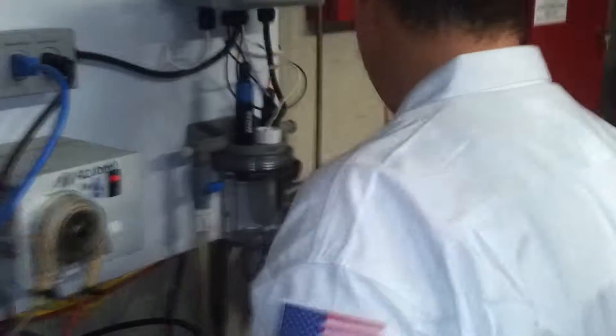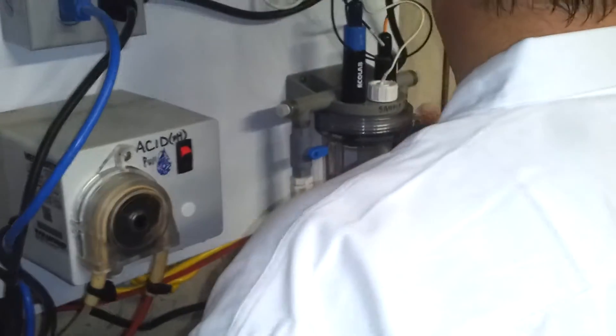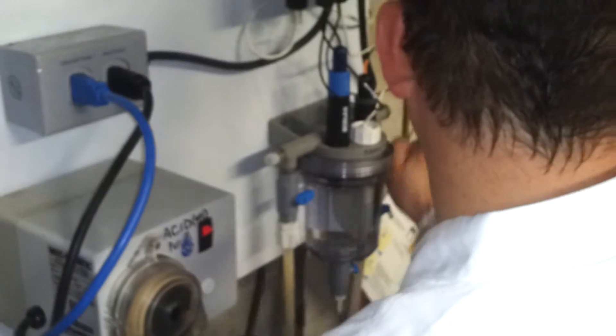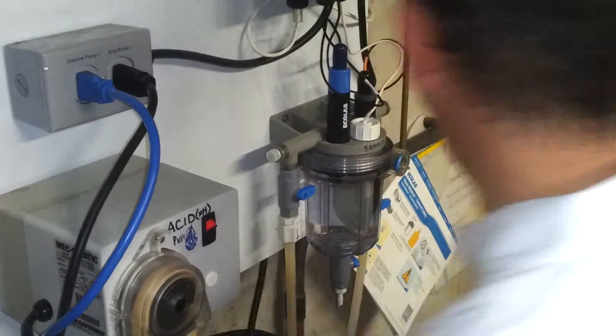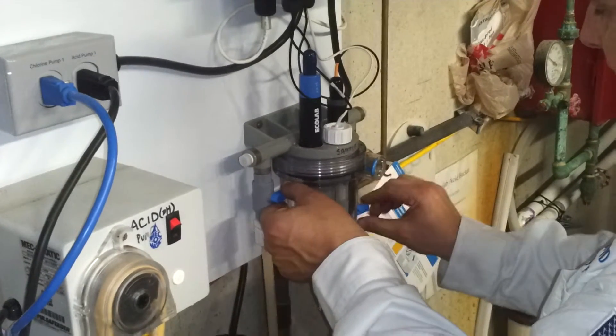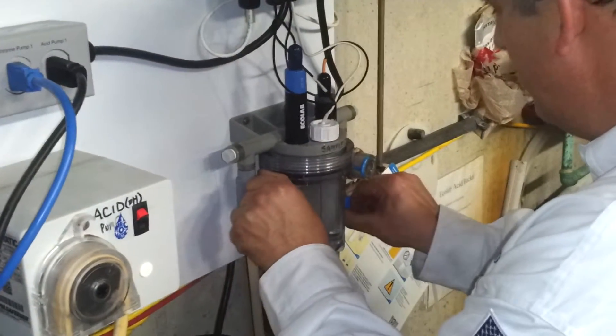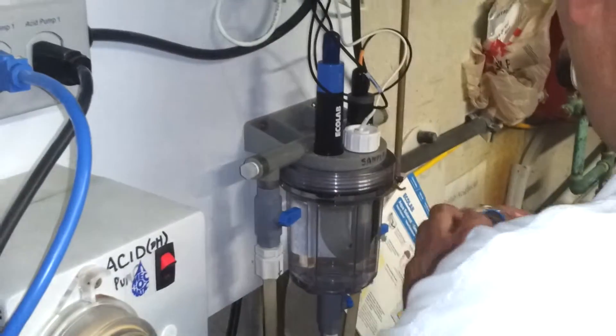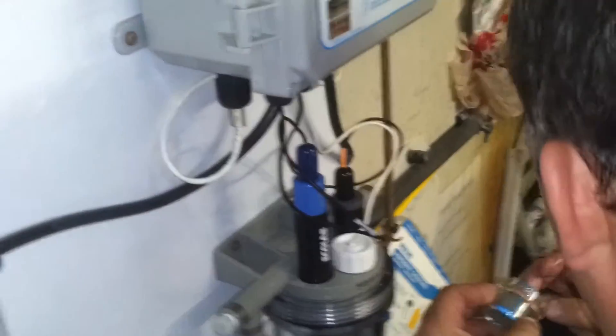Once you're done, you take that screen and that cap — it has an O-ring right down inside — and screw that right into place, just until it's snug. That inline strainer is done and we open up our valves. If you ever notice a leak, like we've had a leak going here, then we take it apart again and see what we didn't get directly back into place.